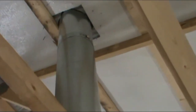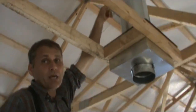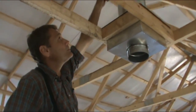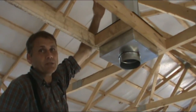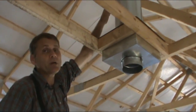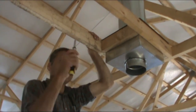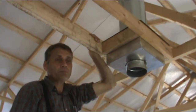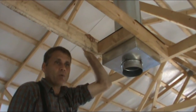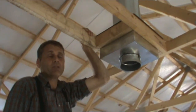And that's one thing I would do different, for sure, is to pre-fit those while I'm on the ground. Because while I was up there, I wasn't sure how far they would fit together. And so I believe that they're completely seated. But I would make sure and pre-fit everything so you know beforehand rather than when you get up there. And the other thing I would do different also would be to make sure I have a Sharpie to mark on the metal. And one other thing is I would definitely use the angle grinder versus the Sawzall.